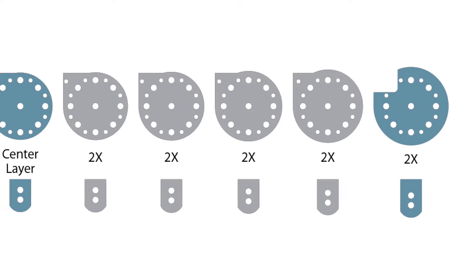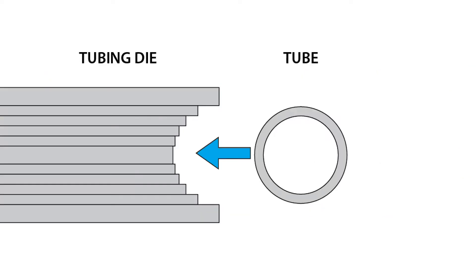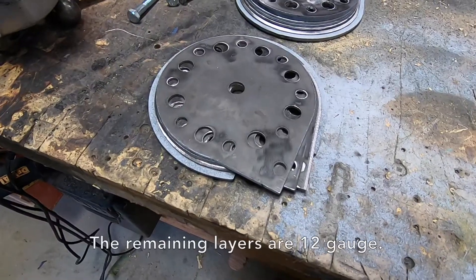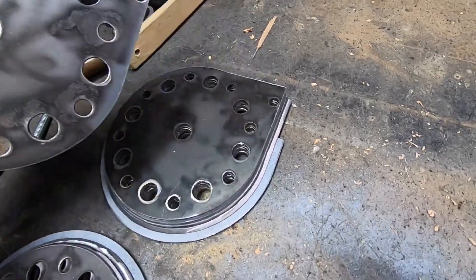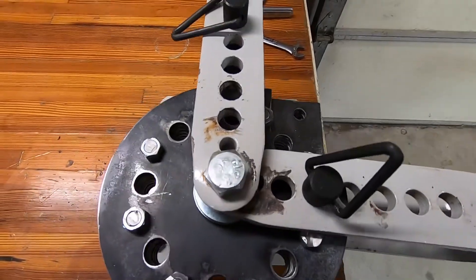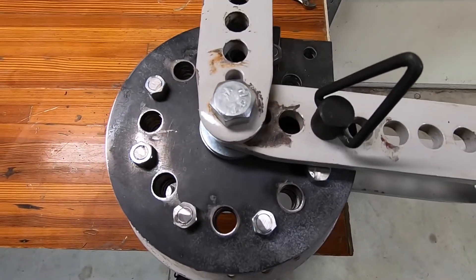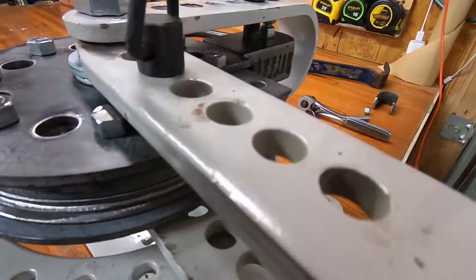Here's a little bit more detail about how this thing is assembled. The die is made of a bunch of stacked up layers. I tried to get the diameter of each layer correct so that when stacked together it would match the radius of a 1-inch OD piece of tubing. Everything is just bolted together, and the larger holes are so you can use the pins from the original bender to reposition it. It's also set up so you can bend a full 180-degree turn if you'd like.